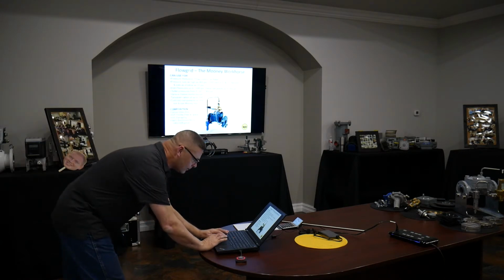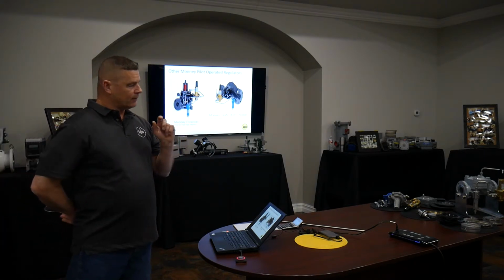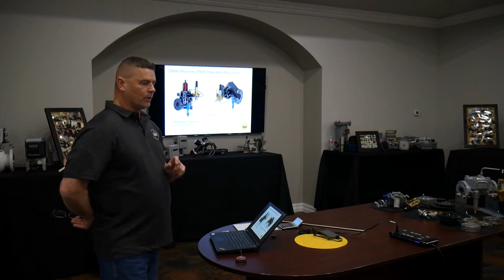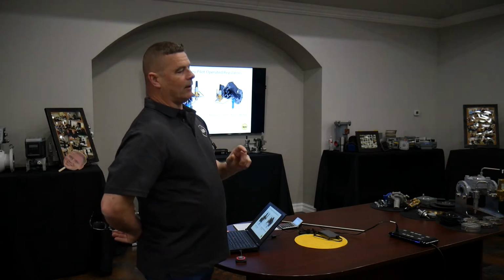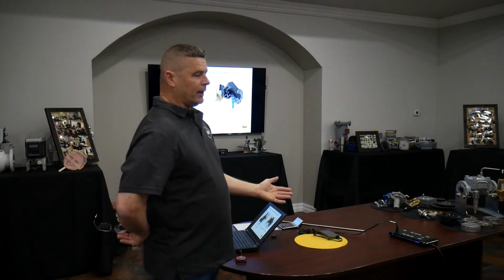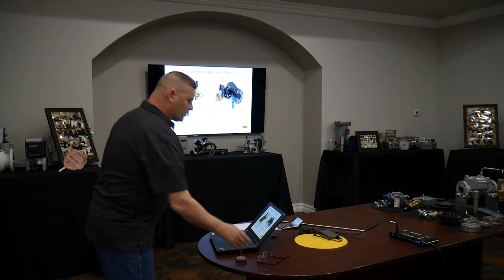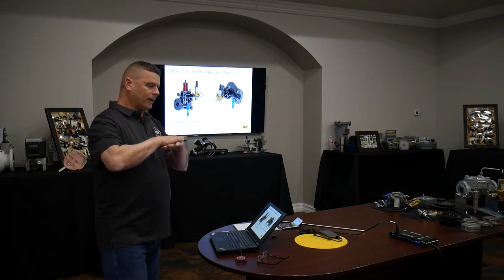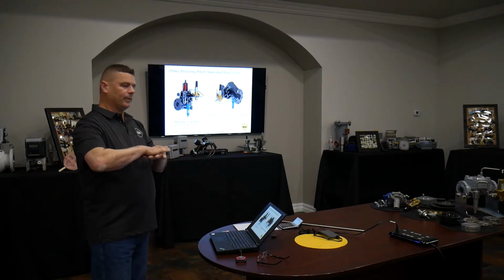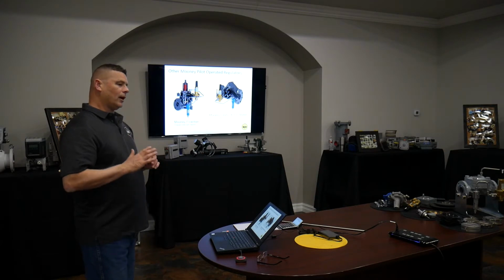Let's move on. Oh, and by the way, it's not good for low pressure cuts. So it does have its limitations. Among its many strengths, we don't want to use a flow grid when we're trying to cut 20 pounds, have a 20-pound differential. So if I'm cutting 40 to 35, I don't want to use this regulator. The reason is because we're talking about a valve that gets good shut off when it has the ability to put enough pressure on top of the diaphragm onto the throttle plate to keep it shut off, even when there might be a little debris, even when there might be a little wear. So I want to make sure that valve will shut off where it's supposed to.